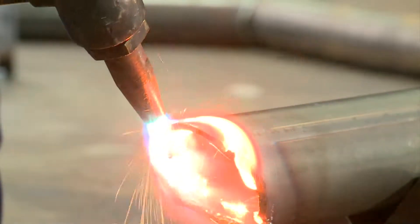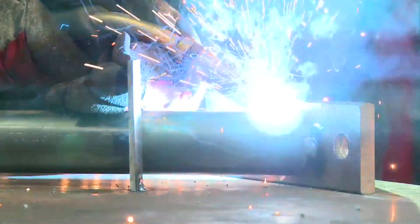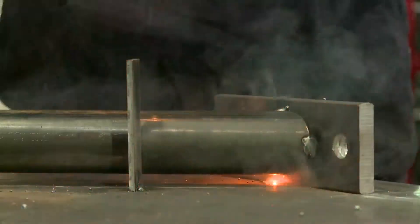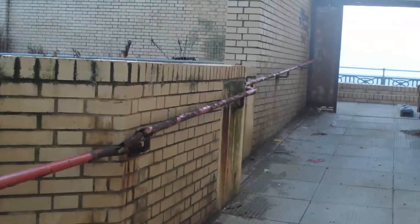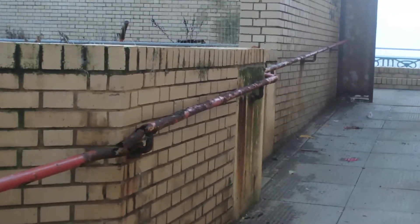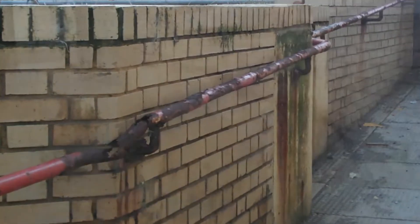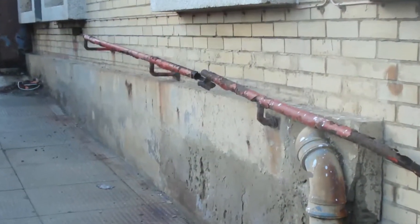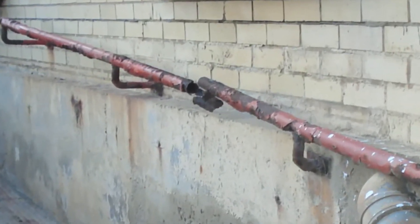Cutting holes breaches the metal's anti-corrosion coatings, which are then further compromised by welding. Corrosion properties can be restored by painting the fabricated rails, but this has to be meticulously maintained to ensure lasting protection. As many components of guard railing are hollow, internal corrosion where coatings have been breached is also a major problem, and often not evident until it's too late.